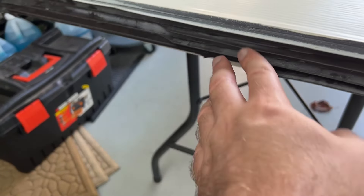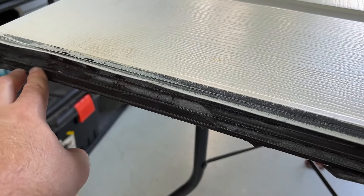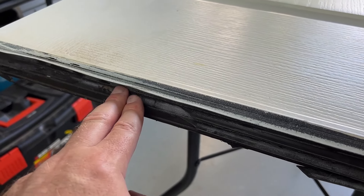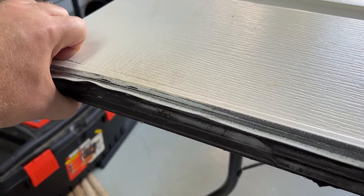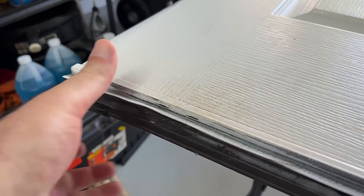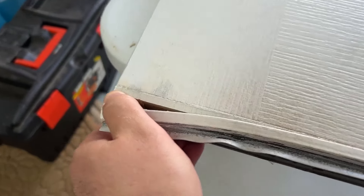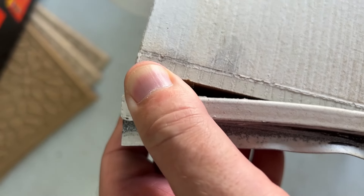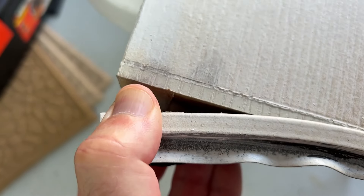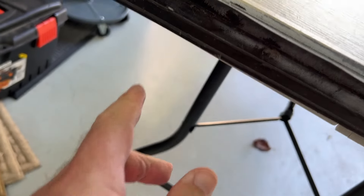These are in, if it's an OEM door, usually just with two strips of rubber in channels and you can just pry it off. It's going to take two hands, but you just pry it off. And there you can see — I'm looking to make sure it's got a channel and not screwed or nailed on. Sometimes they are.